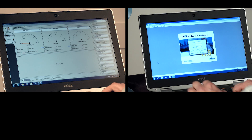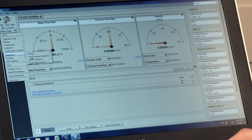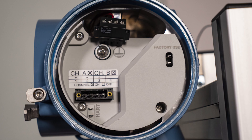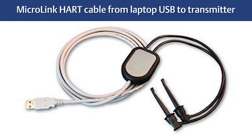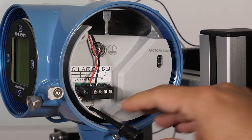There are many ways to communicate with your transmitter. We will focus on using the ProLink configuration software with a 4200 transmitter in this video. For all configuration tools except the display, you must have an active connection to configure the transmitter. To connect the 4200 transmitter with ProLink, we will need a MicroLink HART cable and connect from the laptop computer USB port to the HART terminals on the 4200 transmitter.